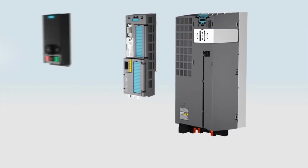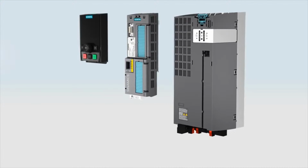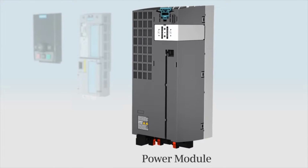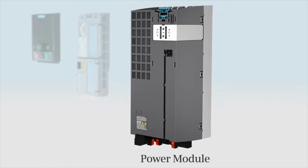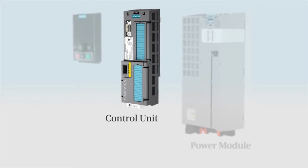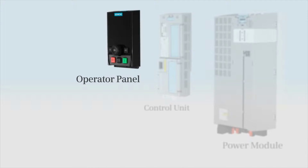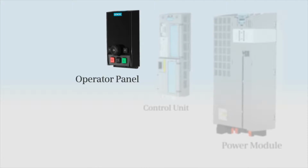SINAMICS G120 has a modular design. It comprises 3 components that can be individually combined. The power module accommodates the power electronics. The control unit controls and monitors the application. And the optional operator panel allows the inverter to be locally operated.